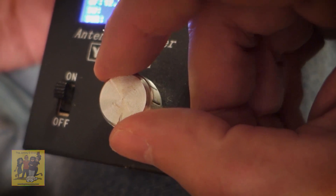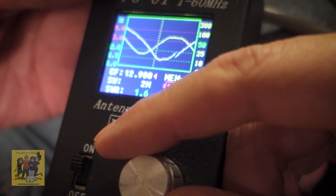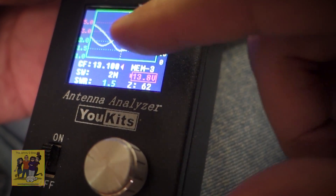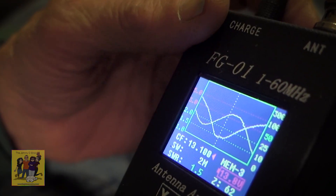I'm changing over the frequency and it's going up higher. The yellow is the impedance if I'm understanding correctly. The SWR is at about 1.2, and the green line shows about 50 ohms impedance. So that 50 ohm line is right about there - I am literally at about 50 ohms impedance. That's really good, that's what we want - and this is without a balun.